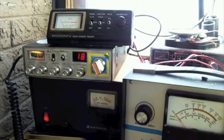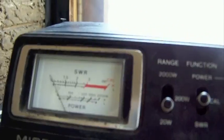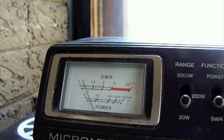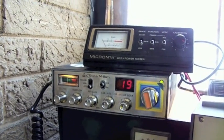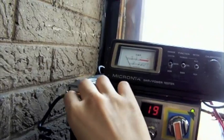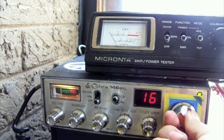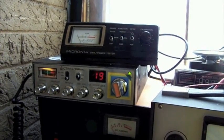Now let's demonstrate this on the meter. Here's the setup this antenna is going to be used with — let's check the SWR. First, let's make sure this is calibrated. You can see it's calibrated. Now look at that SWR — that's great, that's wonderful. Break a 1-9 for a radio check, can I get a radio check please? Yeah, thank you driver. There we go. Reception is great too, but right now there's nobody on — it's just a bunch of noise. There's nobody around the band right now.